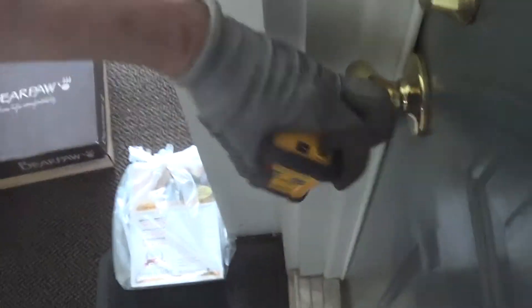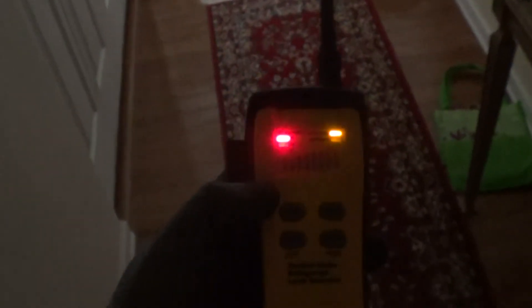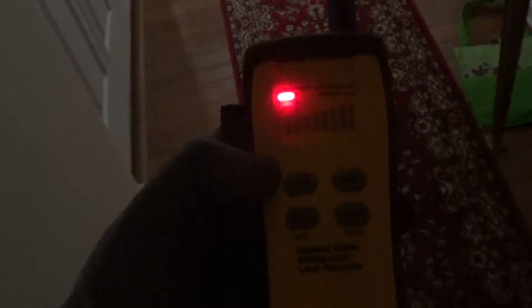When you zero out the house, I'm going to stabilize for the humidity or the contamination — which could be chlorine products or different stuff. This is why guys don't like this leak detector, but it's ten times more sensitive on R410A. So if you put up with the things you don't like about it, you'll be a superstar getting those 410A leaks. I've auto-zeroed for the house, and now I'll do a manual zero — so the house is not going to be setting it off anymore. Now we can find our leak without detecting the house.